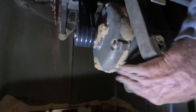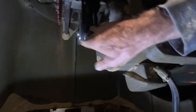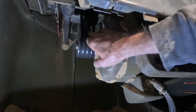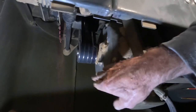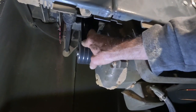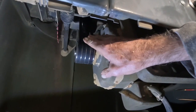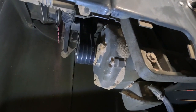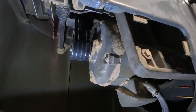If we look up, we can see this thing's got four belts. This is a five-horse, three-phase motor, but it doesn't need four belts to turn the blade. The reason it has four belts is for cushion. This machine is one that it's best adjusted with it running, which can be kind of tricky, but it's one of the best ways to find it or incrementally adjust it until it runs smooth.